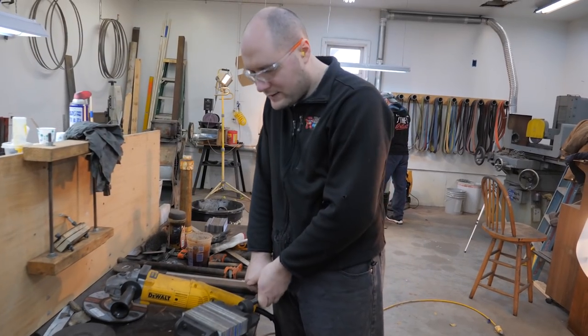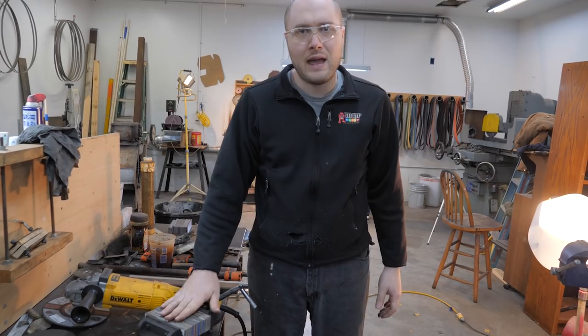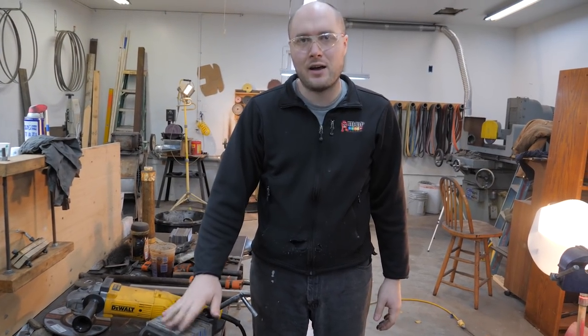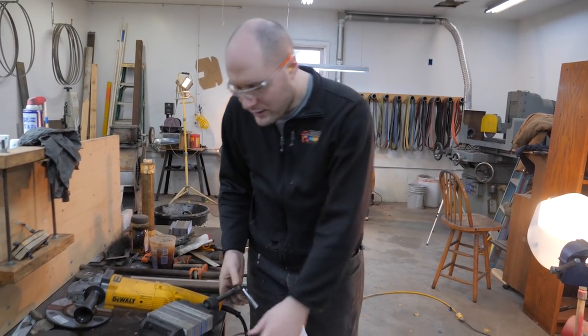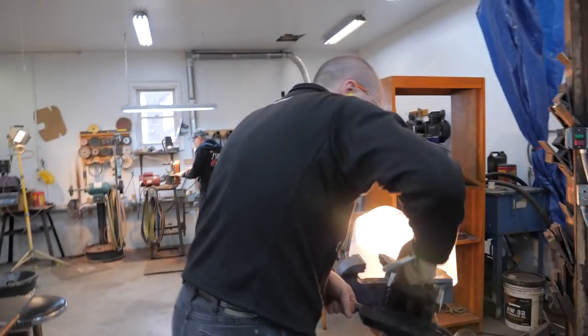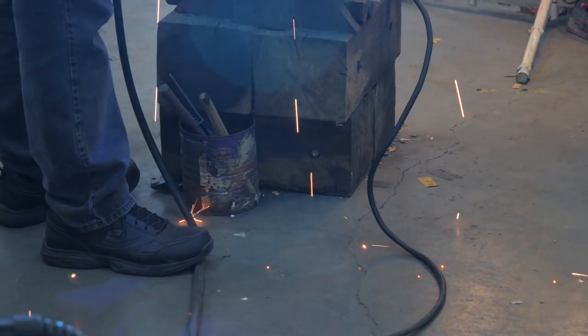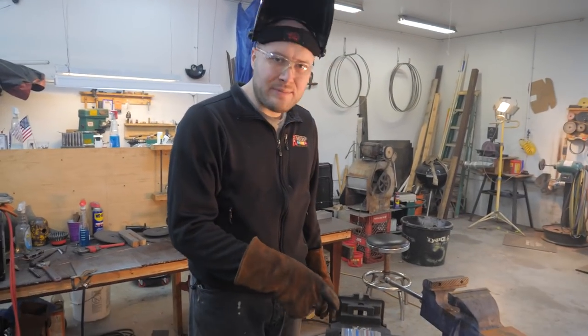The sheet metal is to keep the billet completely out of atmosphere. So it'll be an enclosed atmosphere, so none of the layers are exposed to any oxygen. In the end, I'm gonna have all the seams covered completely.